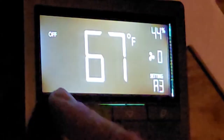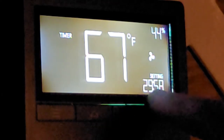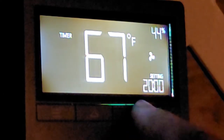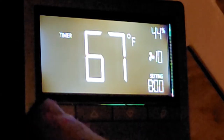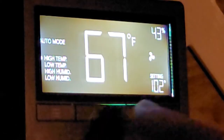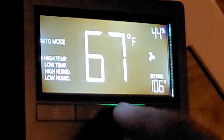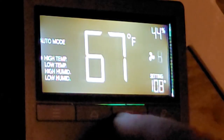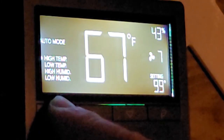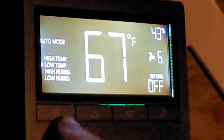I'm going to go through it from off to timer mode. I can set it for 29 minutes and 56 seconds and just change it. You can hear the fan is on now. I'm going to go to auto mode — it asks for a high temp. I have it set at 102 degrees, and I think 99 degrees is pretty good to kick the fan on. Low temp I have off — I don't want it turning on at a low temperature and sucking all the warm air out of here.